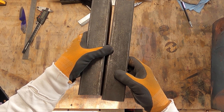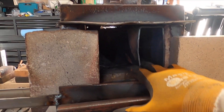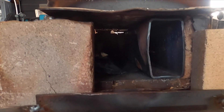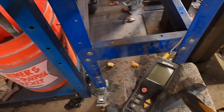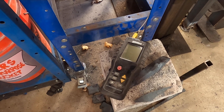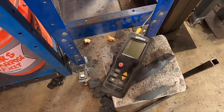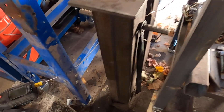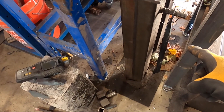Ninety percent of the time the warp comes out with no problem. Here's where I place the baffle — I don't want to put it directly under the burners, so I shift it over to the right a little bit. I also use a thermocouple just to keep an eye on the heat; if it's getting way too hot I'll turn it down a little bit. In the end I just use my eye to judge the color — it's usually pretty close to the temperature I want. Over here at my quench tank, while the forge is heating up, I'll heat that piece of steel up.